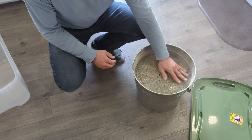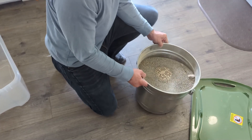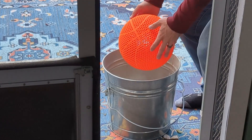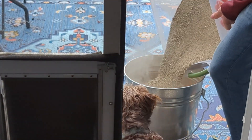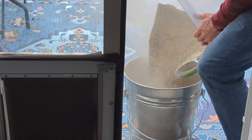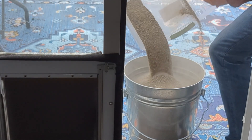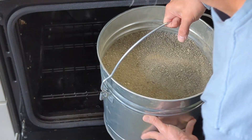After completely covering the ball in sand, I had to make sure to toss the bucket around and get the sand into all the little nooks and crannies, and then cover the basketball completely to prevent any warping or deformities. Then I had to repeat the same process for the orange basketball — just pour the sand on top, move it back and forth to get in all the nooks and crannies, and cover it up completely.